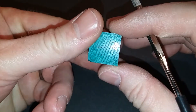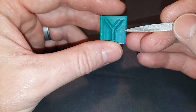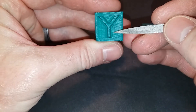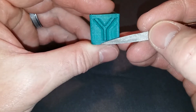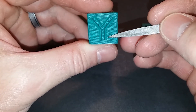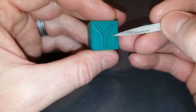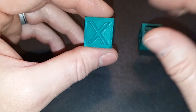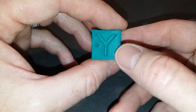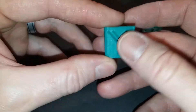Here's the underneath, which is damn near perfect. And here's the top, which is also good. So here's the one with the TL smoothers installed. You can see there's just minor ghosting, which can probably be tweaked in Cura. And remember, this is at 100 millimeters per second printing speed. I've never printed successfully at 100 millimeters per second. There's minor banding there, minor ghosting. Here's the bottom. Here's the top.